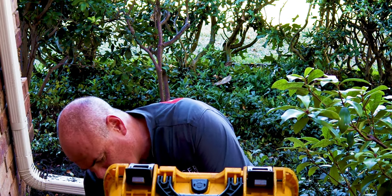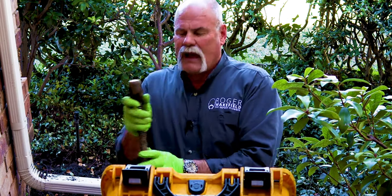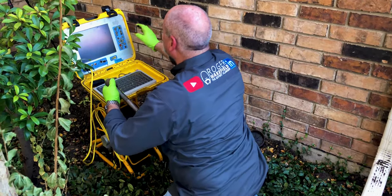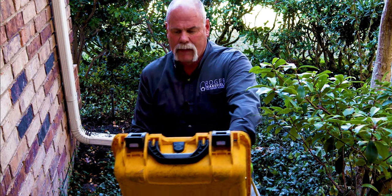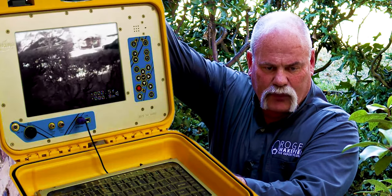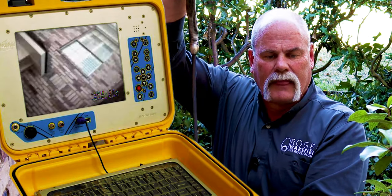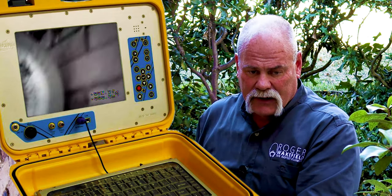What I'm doing is getting everything turned on and fired up. Y'all heard me talk in other videos about running a camera and pulling the head off. Well, I'm running in a full four-inch sewer line, so I am not going to pull the head off — I don't need to, and I want it for safety. Now that I've got everything on and going, I'm going to reset my counter. One thing I like to do when I start recording is show people the outside, let them see that this really is their house. I can see trucks, I can see things, I can actually look up and see the house, so they know this is their sewer.